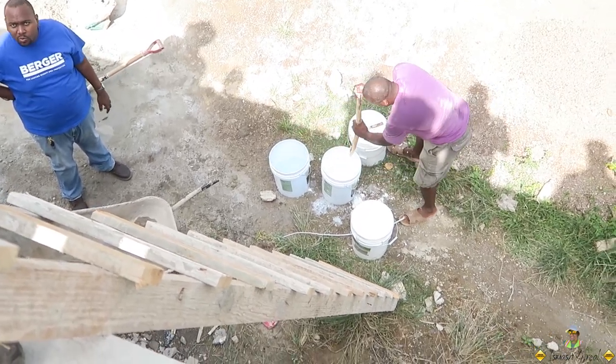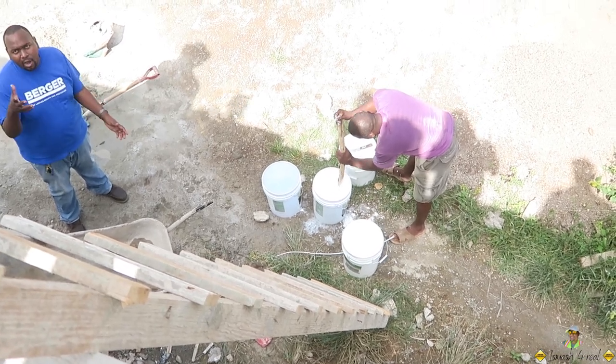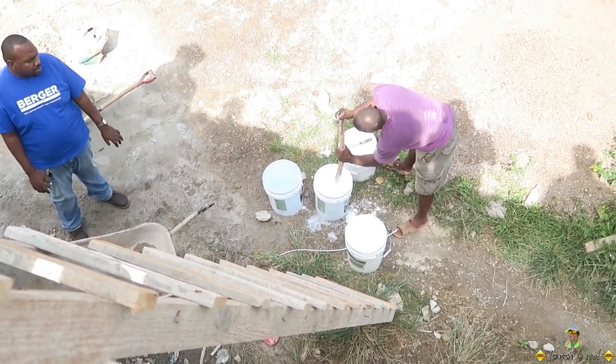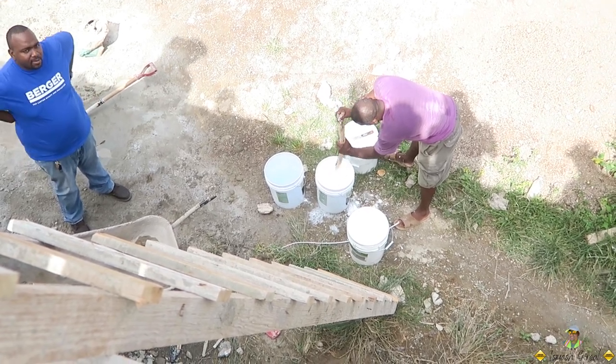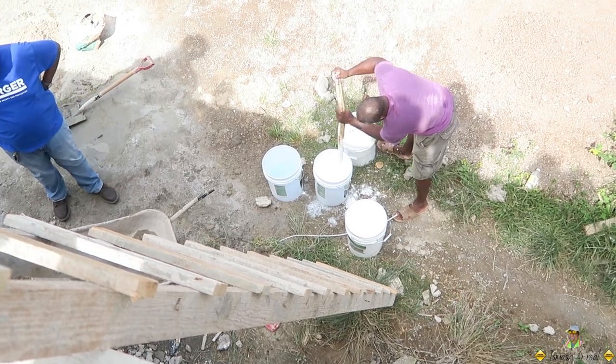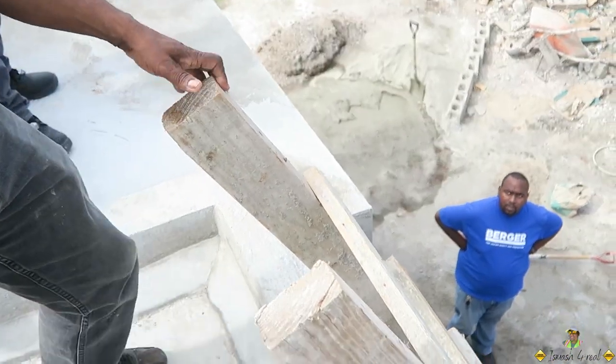That goes up to the 5 gallon mark. No, that's the water first. Yeah, that is it. Especially with the steel float, you need even more penetration than normal, because it does not have many protrusions to grab onto. So it has to go down into the decking.